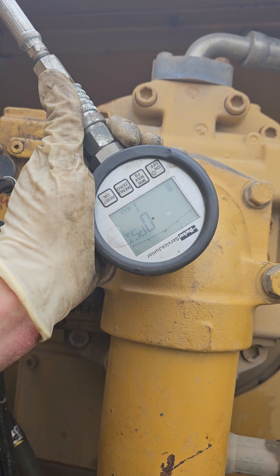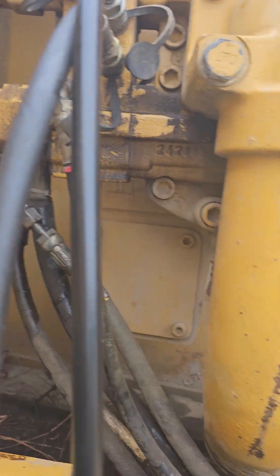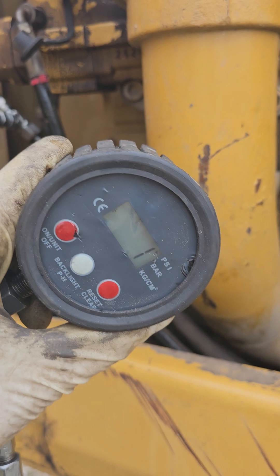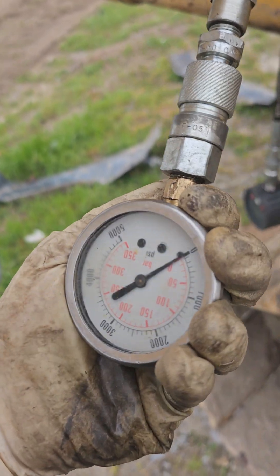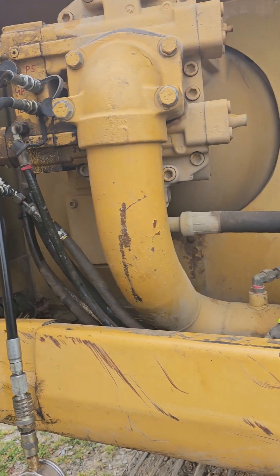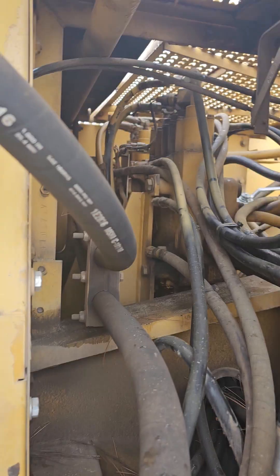What was happening was this side was de-stroking, meaning the plate inside was going almost flat and the pressure was going up to 5,000 PSI. The other side was not de-stroking, and I was bummed because I wanted it to de-stroke — that would have been an easier fix and much better news for the customer. The pump pressure wasn't going up at all: high volume from the lower one but no pressure, which matches the problem.